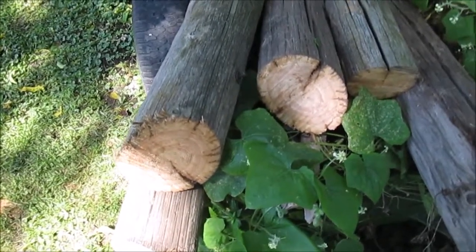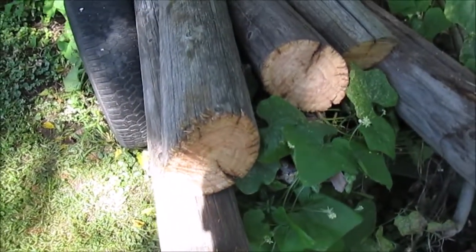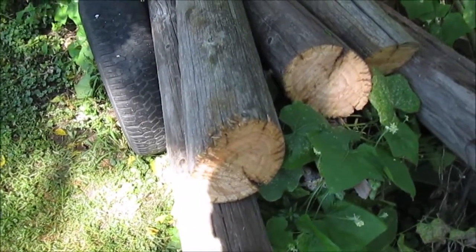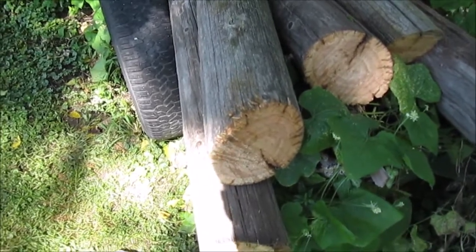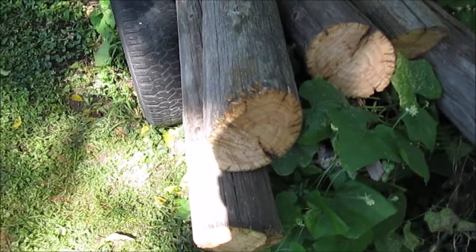Whatever, however it cut. Would not recommend burning creosote wood in a wood stove. I want to use this for kindling wood, just to start the stove every day and not really burn it like firewood, because with creosote in it, you're going to soot up a chimney really bad.